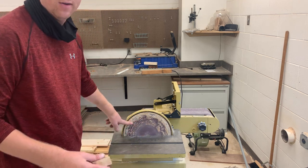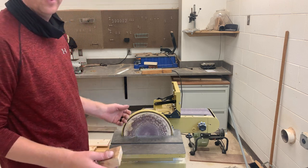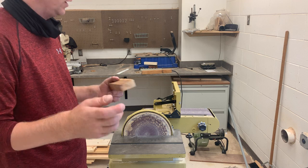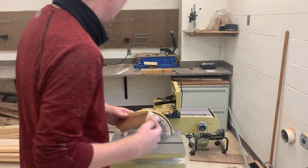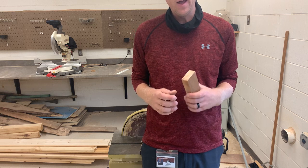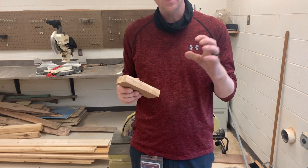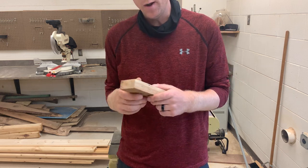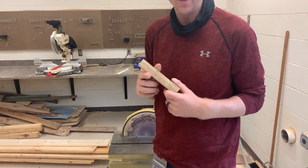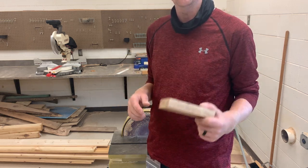Right now our disc is pretty worn down — I'm going to get a replacement soon. But if you ever notice there are a lot of wear marks under this sander, let me know so we can change it out. The belt on the belt sander still looks pretty good. All three of our power sanders take off a ton of material at once, so if you only have a little bit to sand, I would not recommend these machines. Instead, grab one of the palm sanders or do some hand sanding, because if you use one of these machines you're going to go past your line within seconds. We're only using these machines to take off a significant amount of material quickly.